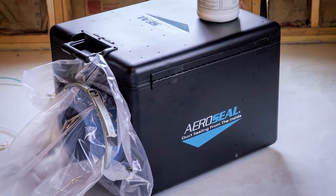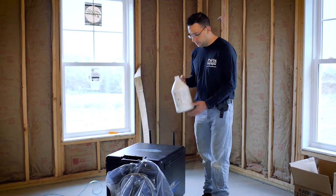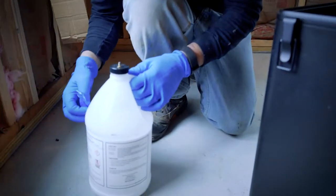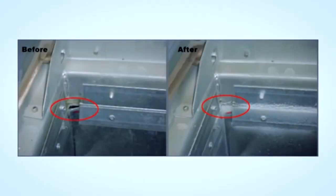This is the HomeSeal machine from AeroSeal that we have. What it's going to do is allow the AeroSeal sealant to flow through and go all the way into the duct system. This tube will inflate along with the other two tubes. Wherever there is a hole in the duct system is where this glue will fill — it will not coat the ductwork as a lining, it will only fill where there are holes.